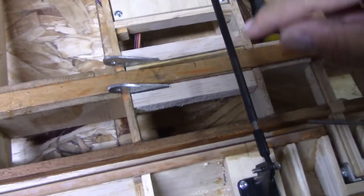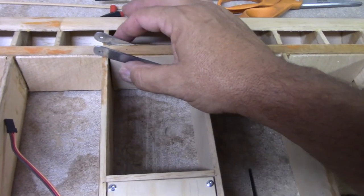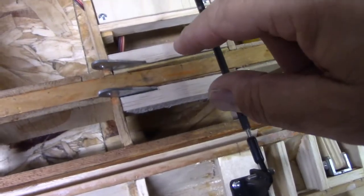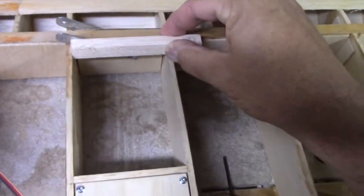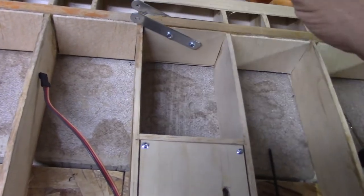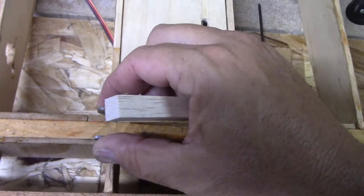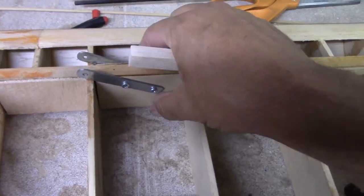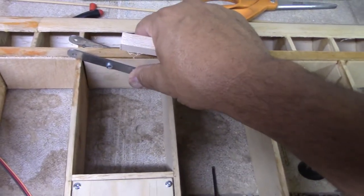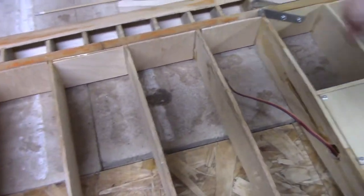The other thing I did, and I didn't finish it off, was I decided that I'm going to need to extend this piece. I'm dropping stuff on the floor, sorry about that. Because when this gets covered, I don't want it to be open. I want the covering to attach to something here. So I'm going to do the same thing on this side. I just took some balsa and here they are. I'm going to have to rip some more for the other side too. This is just cut to length to come down inside. And then I've got to cut this groove out just for it to slide down inside. So once this is down inside here like these, you've got a really good spot to glue to, and we're just going to call it a done deal. I'm never expecting to have to pull these things apart. It's cranked down, it's all snugged up, and behind this plywood, there is more solid plywood. So you're not going to have to really worry about any more compression. It's just something that I don't see anything loosening up, hopefully. See, I had to throw in the word hopefully.